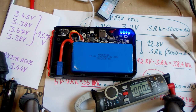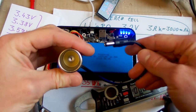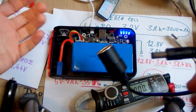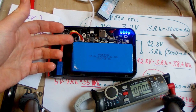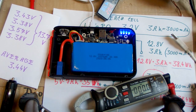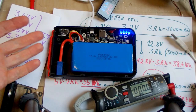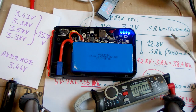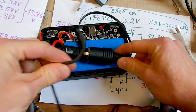I'm not really sure whether the charger actually balances the cells, or whether it just stops when the first cell reaches about 3.6 volts. It seems like there's no balancing, which is a bit disappointing. Now let's measure the capacity of the battery. I originally planned to connect my battery analyzer to the direct output, but it's probably safer to use the cigarette lighter output which goes via some protection circuitry that monitors the voltage of each cell and stops discharge when the first cell reaches the minimum voltage.